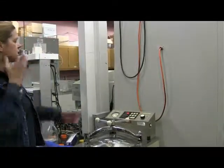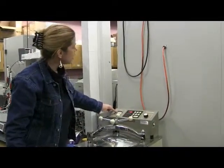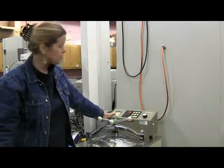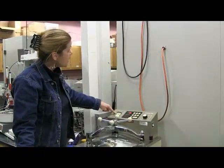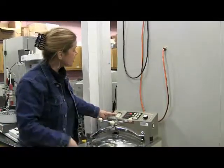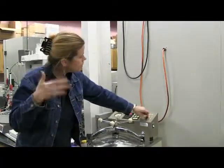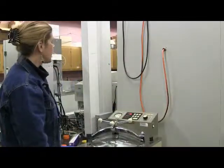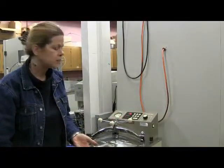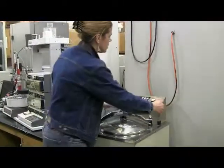It's going to heat up and then reach 121 degrees. There's a pressure gauge here — you'll see the pressure go up, because in order to get to 121 degrees it's got to be higher than atmospheric pressure. When it's done it's going to beep. Then we open this valve and you'll hear all the pressure going off. We have to wait until it gets down to about 100 degrees before we actually reach in and pull out our things. Then you open it back up again and get your stuff out.